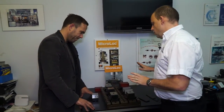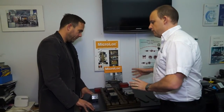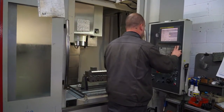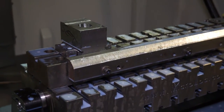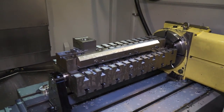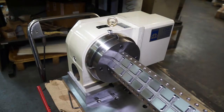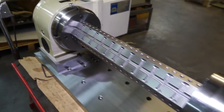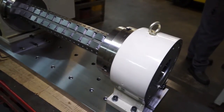So this set up here, Matthew, is for a vertical machining centre? That's right, yeah. What about if I've got a horizontal or a fourth axis unit? Again, we tend to tailor solutions to suit the customer requirements. For horizontals, we can do four-sided cubes and two-sided tombstones, to fit 300, 400, 500, or even 630 pallet horizontal machines — again designed around what the customer requires.